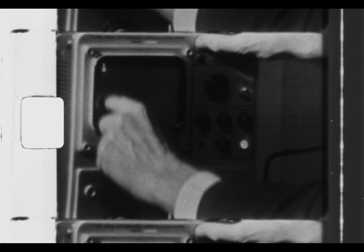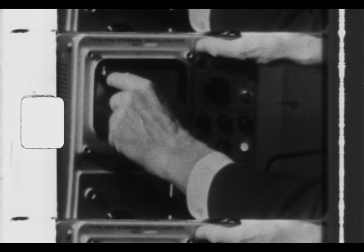Yes, I get a pulse. That same little bump is there, but that is not normally there — it's some aberration which has just occurred. I get various traces and I can locate the spot exactly at some position here. Then I'll measure voltage from there down and voltage from here over. I can still see that little spike there, which is presumably some odd pickup, perhaps from the television cameras.